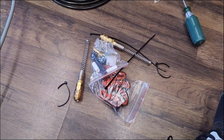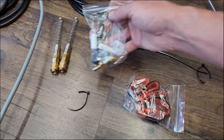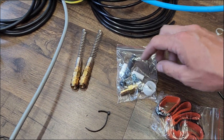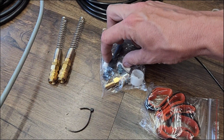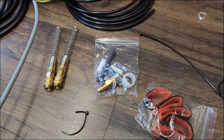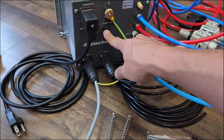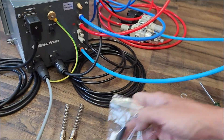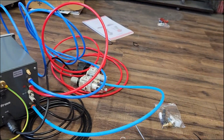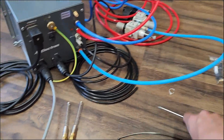In the little spares bag you've got your quick connects — that's for your red and blue hoses. You've got some spare parts: this is if you want to do a hardwired setup, we don't use this or the clamp. This is an extra injector, two extra filters that go in your pump, and this can go on the tip of the gun and you can twist it to close the mouth for a narrower spray — kind of nice. There are also a couple fuses in there in case you blow a fuse. You have some hose ties — it's better to use electrical tape when you're wrapping everything up.